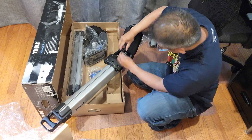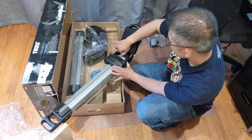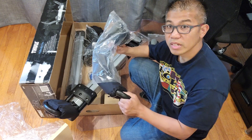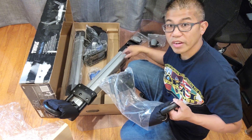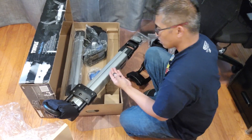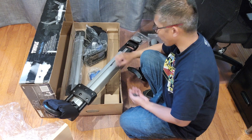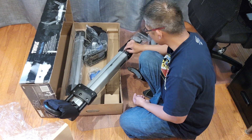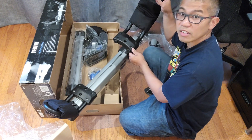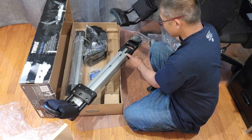Take your little knob and go ahead and place it on that top hole. This is used to tighten — make sure it's in place. Now take the bigger bar and connect it on the other end. Take these square nuts and slide them into the track — that's how we're going to bolt this into place. This part is in a fixed position while this part is adjustable, so we want to fix this to the furthest it can go.